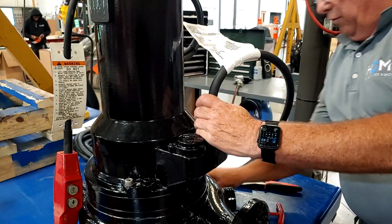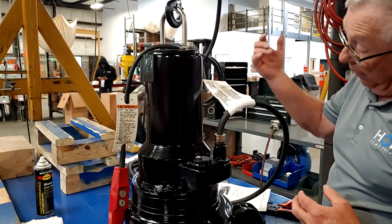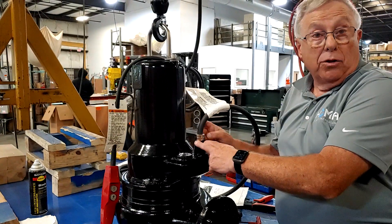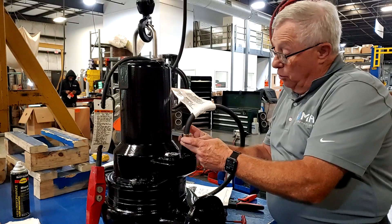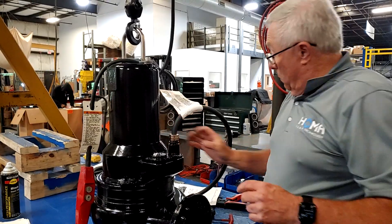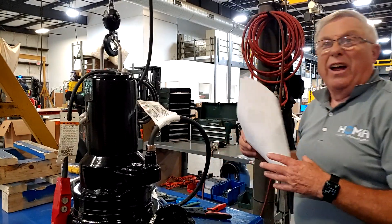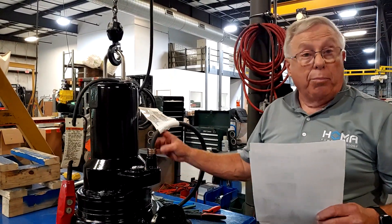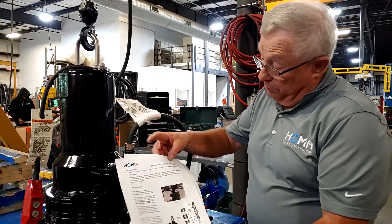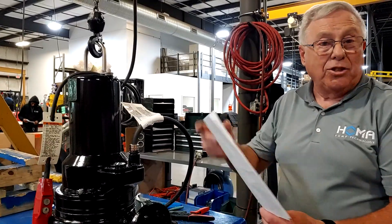There — we just did a voltage change from 230 to 460 on a T motor. And if I had cable and was replacing the whole cable, we'd loosen up here, send a new grommet, put new grommets on the cable, tighten it down, and go on our way. That's an easy way of doing it in the field without having to remove the stator housing, since you probably don't have a way of lifting it — and it's a little cleaner and less work. You can always go back to our website and pull the T motor replacement cable installation for the step-by-step. Thank you very much for watching — we'll see you next time.